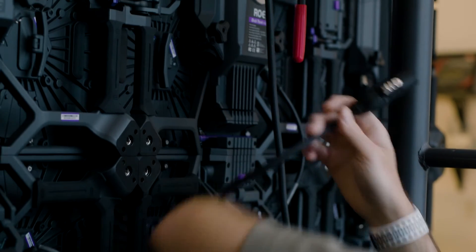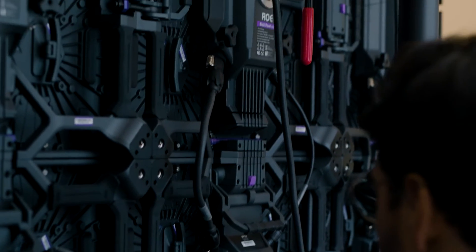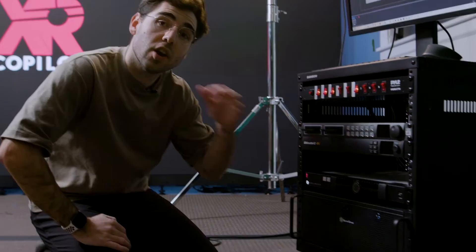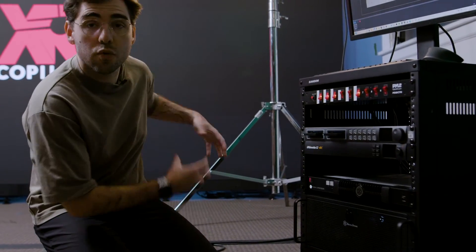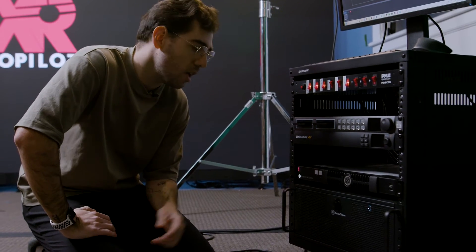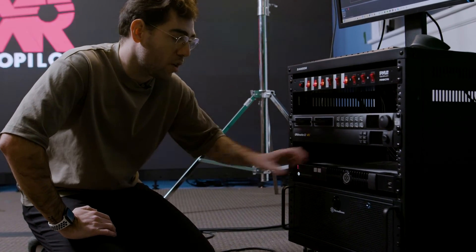You can change the bit rate in the computer, but ultimately it depends on the type of processor you have and the number of inputs. Because we're using a Brompton S4, we only have four inputs, and based on our LED tile count we can plug in up to 13 tiles per group. Once you've daisy chained all the data cables, you'll have four master outputs going into the processor. The Brompton processor essentially acts as the power button for the LED wall — hit blackout mode to turn it off. So once your power is plugged in, your data is plugged in, and your processor is set up, you are ready to use your LED wall.